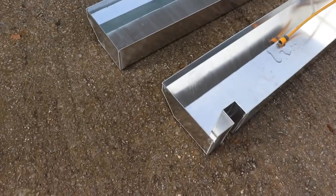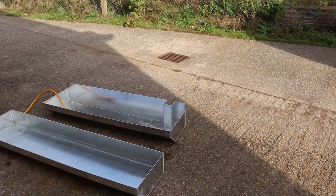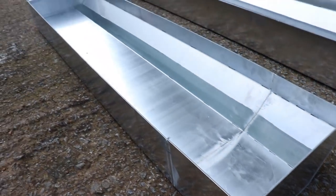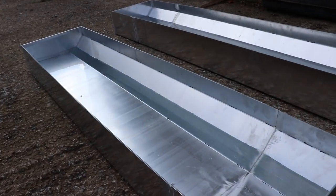This is the last little piece going in now - this little channel. Again I really didn't clean it well enough at all, so you can learn from my mistakes on that. If you've got a plasma cut edge you need to really get all the plasma cut surface gone before you try and weld it. I'm just trying to fill a little gap up on that corner - that's just a case of building the edges up a little bit as you move along until you can fill it all in. So that's the finished trays - I just put some water in them and left it there for a while just to check that there was nothing leaking out. They're only holding water so it's a good enough test just to make sure they're going to do their job. That's going to be it for this little job - cheers for watching and I'll see you on the next one.